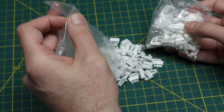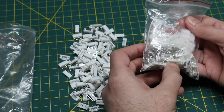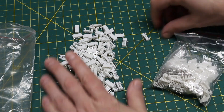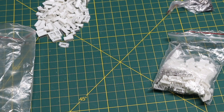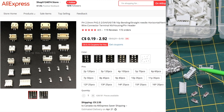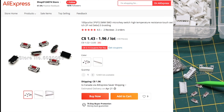Board side connectors here and then pins and housings over here. It looks like I bought six-pin regular vertical as well as right-angle two-millimeter pitch connectors, and the housings and crimp pins to plug into them.